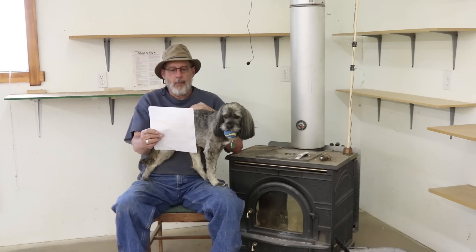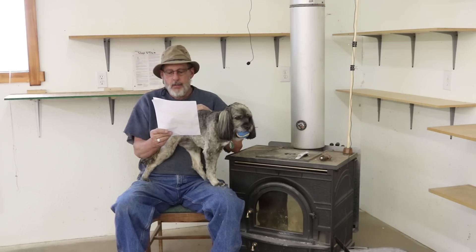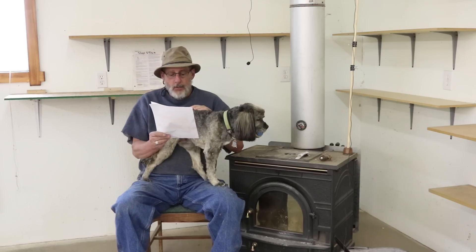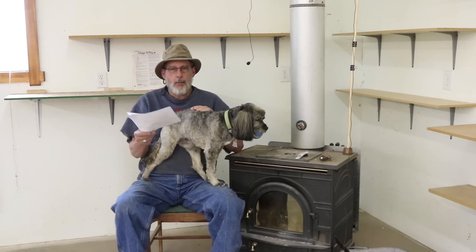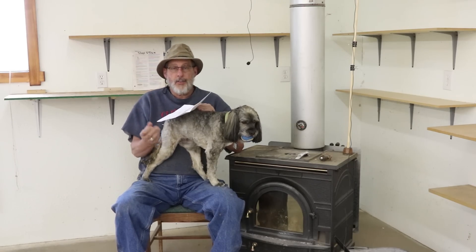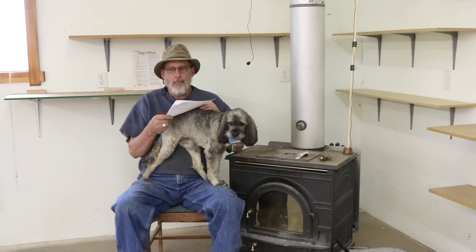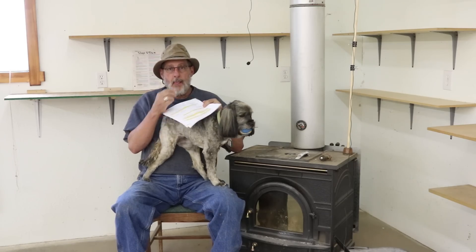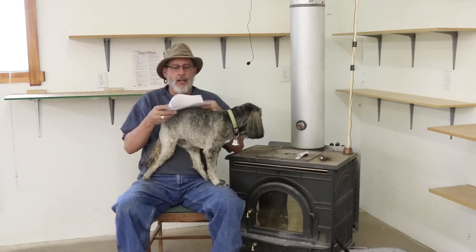I made a video on a router table. Billy asks, 'Where did you get the router plate, and how do you adjust the height of your router?' If you go back and look at the router table video I made a month or so ago, I cover all that. I got the plate and the leveling devices that go underneath the table from Woodhaven — I'll put a link to their site. The miter slot I used in that router table also came from Woodhaven, and I've got one in my bandsaw table as well — they're really handy.